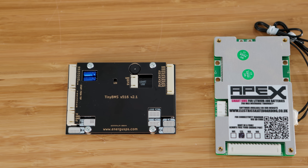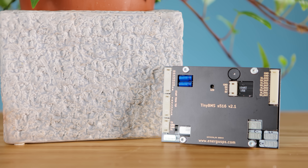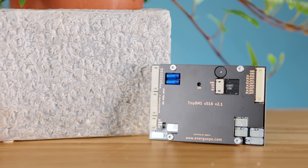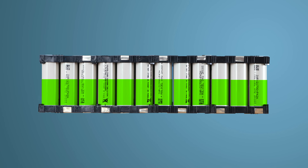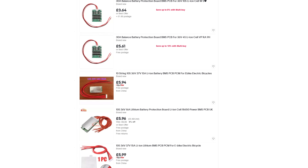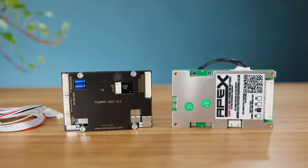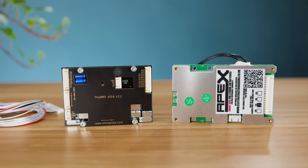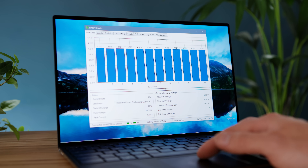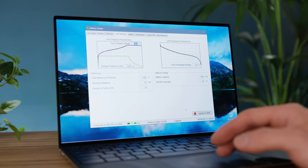This is why lithium batteries need what's known as a battery management system, or BMS for short. They're available in many different sizes for a variety of use cases and can not only provide various power handling features such as overcurrent protection, but thanks to balancing can keep each of the cell rows at matching voltages regardless of how many times the battery is cycled. You can get cheap BMS boards off places like eBay, but for high levels of safety it's a good idea to get a quality branded one. The upmarket ones have some really cool features too, such as Bluetooth and various configurable options through a PC, so are really worth the extra cost.